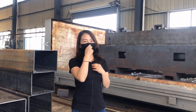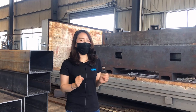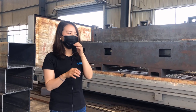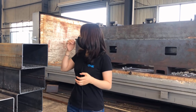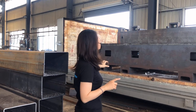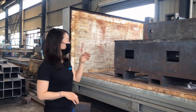Now we are coming to one of our subcontractors. As you know, a lot of companies selling laser cutting machines in China normally do not do the whole process. The first step is making the machine frame in a subcontractor workshop like this. They do the pipe cut and then they weld it to become the machine body. Then the first step is they put this machine in this oven — a very high temperature oven — to give the heat treatment for the machine frame.